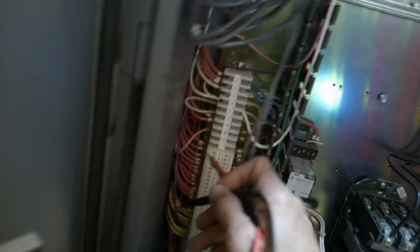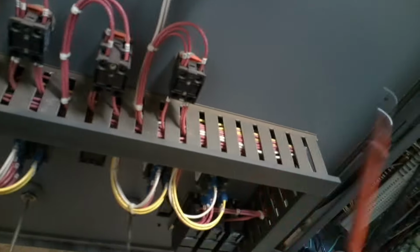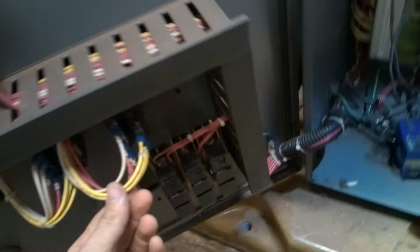Point 26 right there. Then he goes to this pink wire, and the pink wire goes up into the skinny flex, into this guy, up and over and to them. Perfect. Yep. So this red wiring here on the normally open of this high relay goes just to the light and buzzer. Now we've got these 3 here.